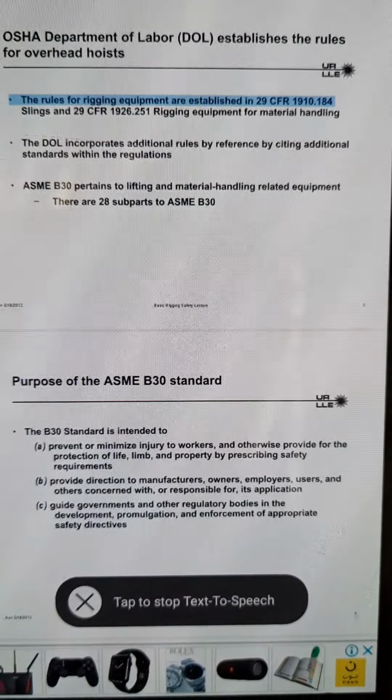Rev. May 18, 2012, Basic Rigging Safety, Lecture 43. Regular nut and shoulder nut eye bolt installation for inline loading with an untapped through hole. More than one eye bolt diameter of threads: use two nuts. One eye bolt diameter of threads or less: only one nut is required. Tighten hex nut securely against load. Rev. May 18, 2012, Basic Rigging Safety, Lecture 44.